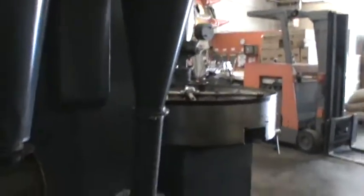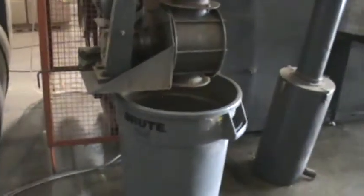So most of the roasting happens with the hot air passing down over the beans. All the smoke is then recycled back down to this burner. So we incinerate everything so we're not polluting at all. There's no heavy smoke heading out the stack. There's nothing at all. It's all reburned. So we have both an oxidizing feature here, reburning the exhaust, and then also the roasting feature